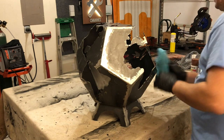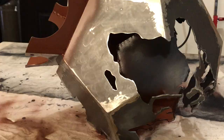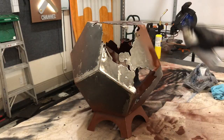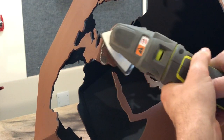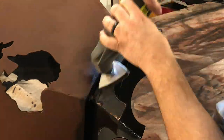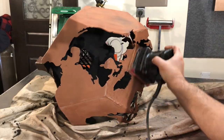As you probably noticed on the thumbnail, as well as me mentioning it, I am not going to use this one for a fire pit. I'm going to throw some paint on it — paint it a couple of different colors — and have it more as a little art piece sitting in the background. I think it's a really beautiful piece. I've also got some LEDs I'm going to throw in it and have it with that nice orange Edison light look just by putting some LEDs in the bottom. At this point I've got the whole thing primed and dried. Now I'm going back with some flat black on the inside. I've then taken some 80-grit sandpaper on a multi-tool to knock down a couple of little high spots, then changing over to 220 with a bigger sander — giving that a quick hit and we're ready to start putting some real paint on it.